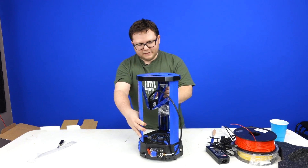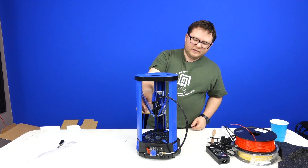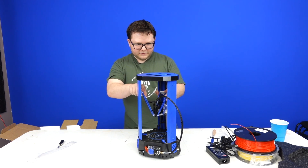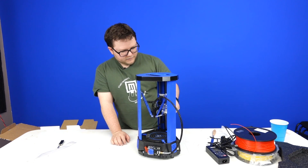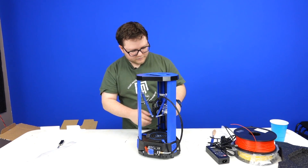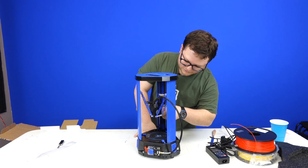The head is very interesting. The arms are a little wobbly, but they're not really any different than carbon fiber rods with Traxxas joints. There's very little free play. The carriages look like they're made with some kind of slick plastic that's going to ride on what look like six millimeter rods — not much different than any other delta printers I've built. I'm not too sure how the linear motion is going to work, but we'll find out in the quality testing when I do my first print.